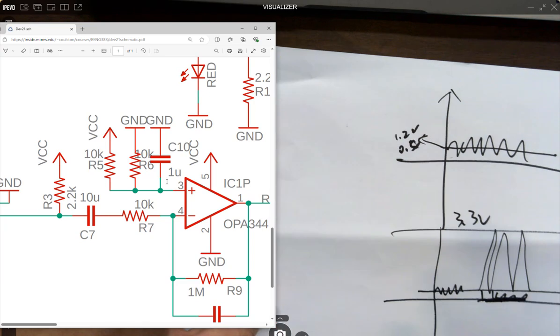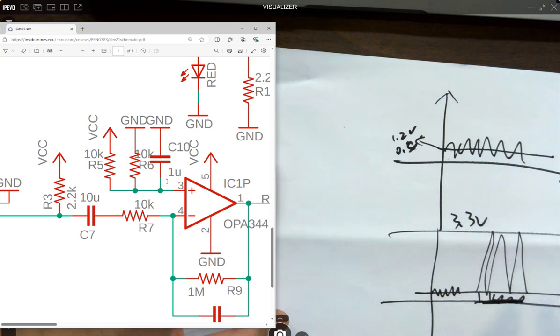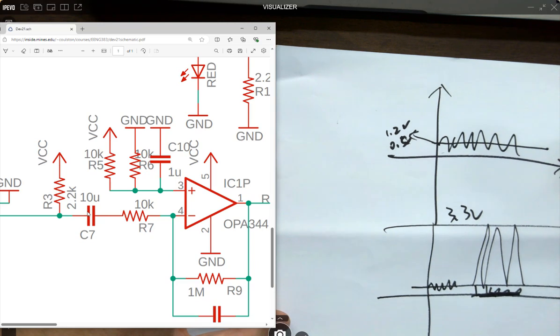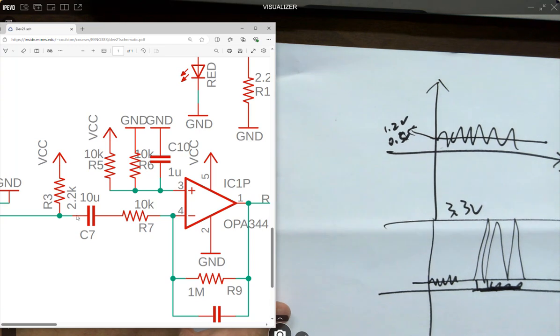So what you want to do is remove the DC offset first for whatever sensor signal comes from the analog world, okay? Remove the DC first, all the time. This is called a high-pass filter. A high-pass filter passes high frequency, which is the AC part of it, and blocks DC, which is low frequency. DC is gone, so only the AC part will pass.